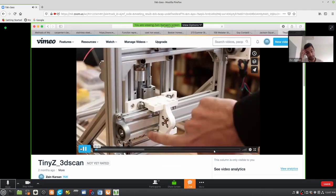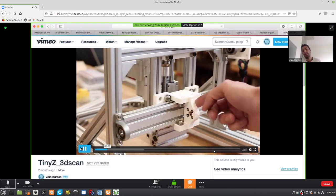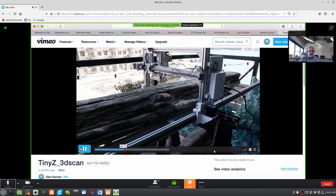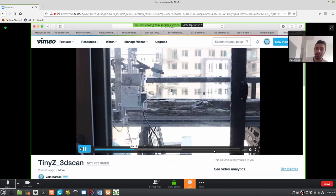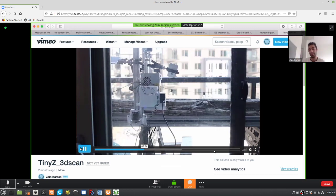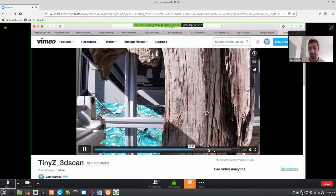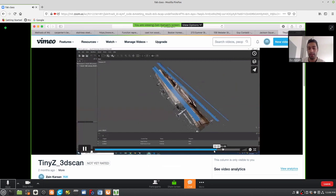All of the axes are driven by lead screws, but you can print your own parts a la Clank with very nice flexure joints, and have longer runs. So this is an X-axis extended to 8 feet with a 10mm GT2 timing belt, and some iPhones strapped to the gantry so that you can take video and then scan whatever you've got lying around your yard or your apartment. The payload obviously is not very much, but with that flexibility, you're able to do a lot more experimentation.